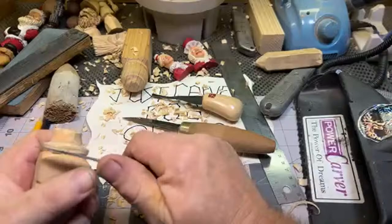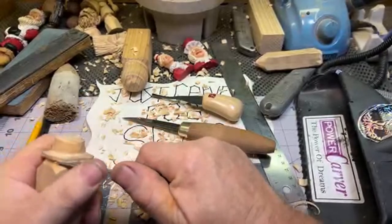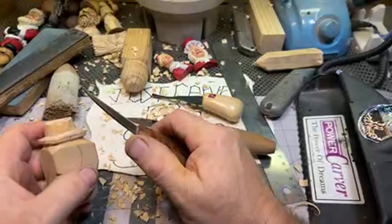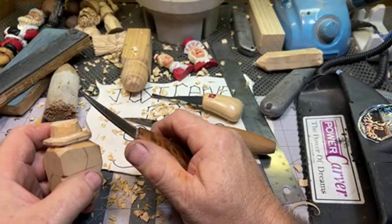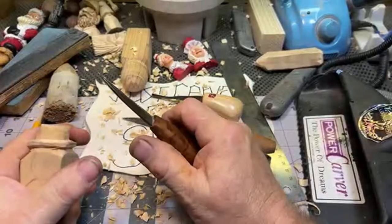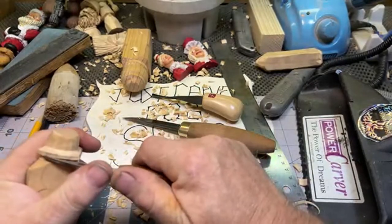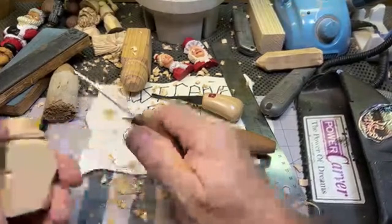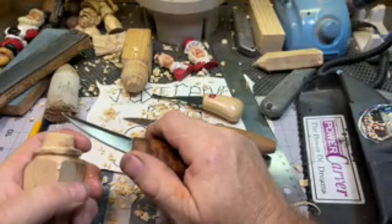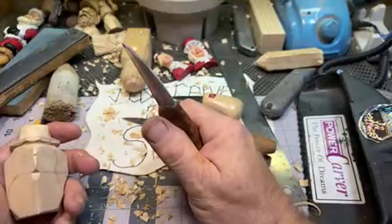Yeah, I like using found sticks for walking sticks, and I would say 98% of them are cracked. So I carve what I want to carve, and then the crack, I'll tape it and fill that crack up with epoxy. That way it kind of guarantees me it ain't gonna crack no more. And you can mix colors in with it to give it a flair, make it, as Kevin would say, more interesting. You make it a little more interesting that way, right, Kevin? Yeah, wood glue works good. I like the epoxy because it's clear and I can mix different colors with it. But I guess you could do that with the wood glue.